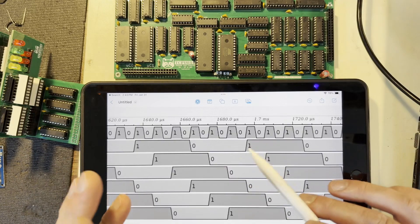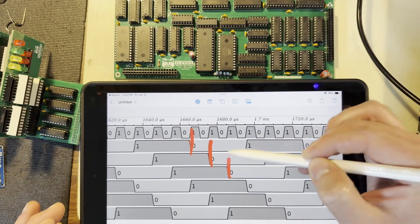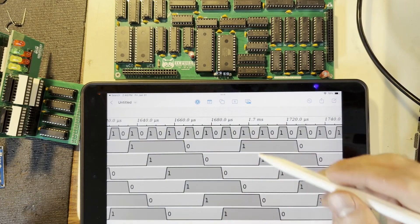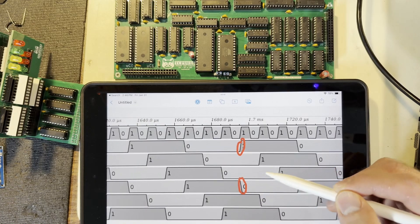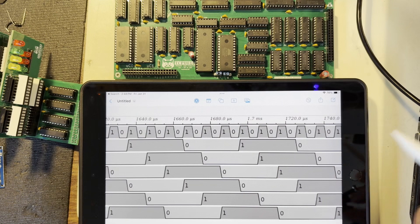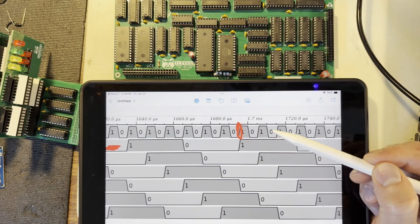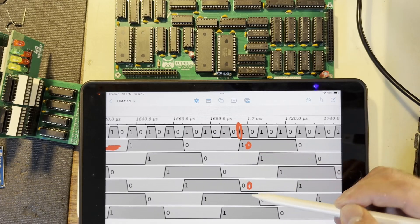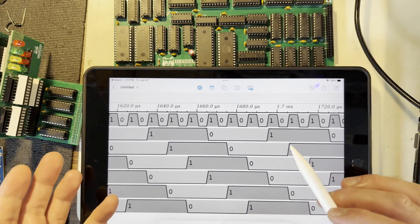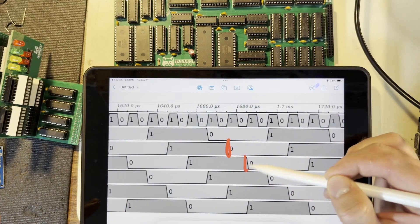So if I zoom in over here, this right here is the logical equivalent of the timing system in the computer. It's a single shift register set up as a Johnson counter, which will produce phases that look like this. And doing this method, even though it makes the design process more complicated, it's nice in the fact that these phases are all equally spaced apart. It's also nice because each of these phases is matched up with a complementary phase on the other side, which simplifies things further because you don't need to worry about inverting clock signals.